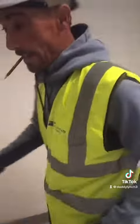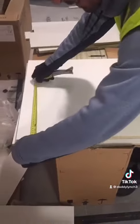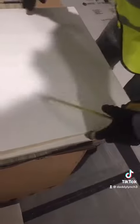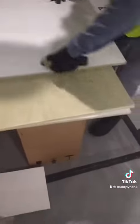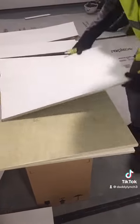So I'll make my way over to the board. Give myself a knife line. I'll wrap it up in tape on the ends so we don't mark any of the boards. And then mark at 350. Get it on there, score it with a knife line, slide over to the ends of the board, straight through here. Leave it — one done.